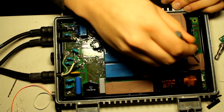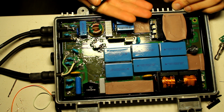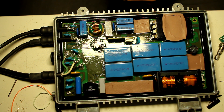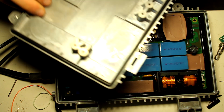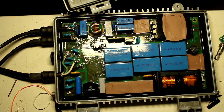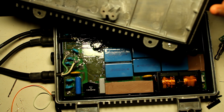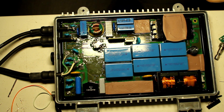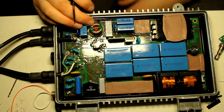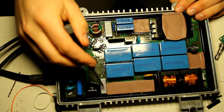These are all thermal pads here. I think the transistors are on the bottom side as well, so they conduct to the bottom side and also to the top side. You can actually see in the top molding there are these extra higher bits that coincide with these thermal pads and also conduct heat up to this side. So thermal management is really good, especially for something that only dissipates less than 20 watts total. You have here the inverter stage and some filtering.